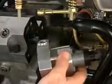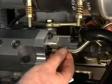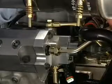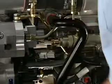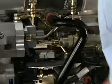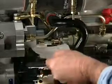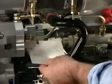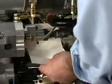Install the fuel pump actuator housing and reconnect the fuel lines and wiring using the procedure given previously in this training. Operate the engine and check for leaks. When checking the pump high pressure fitting, snap the throttle several times to increase the fuel rail pressure.